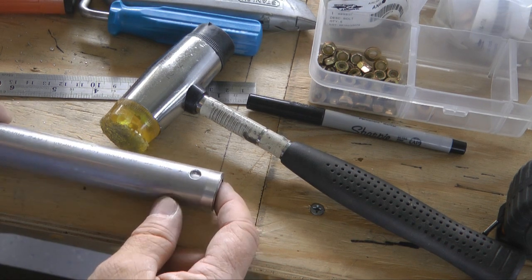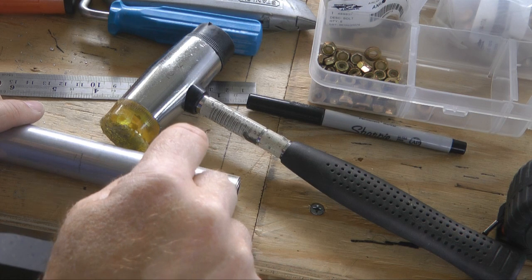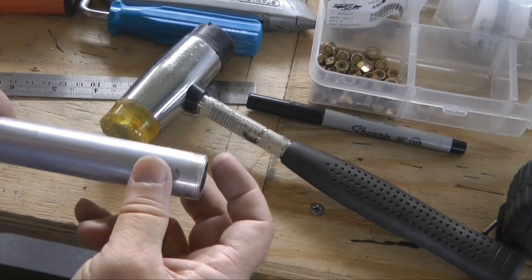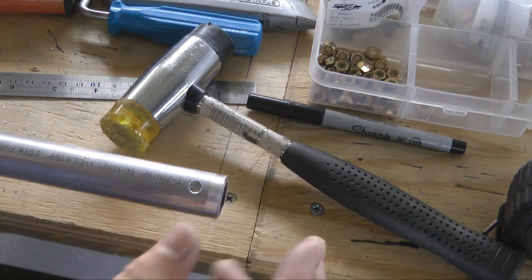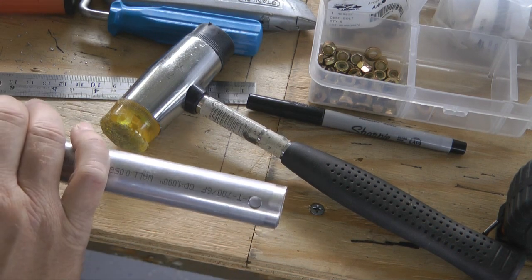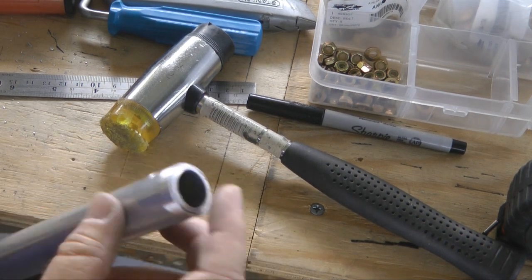What that will do is strengthen this connection. Before doing the drilling, we want to place a 3/16" rivet anywhere in here, and that will lock the inner piece and the outer piece together. Then we can drill. That effectively reinforces the connection where the bolt goes through. It doesn't take long but it really makes a big difference in the strength. We basically have six of these to do — three tubes at the engine mount with two ends apiece, so six little pieces of 7/8" inch tubing to reinforce the ends.